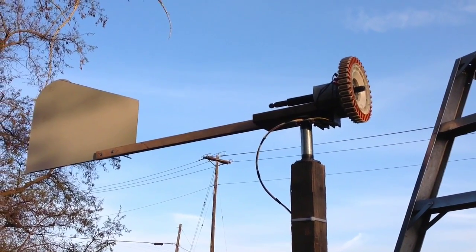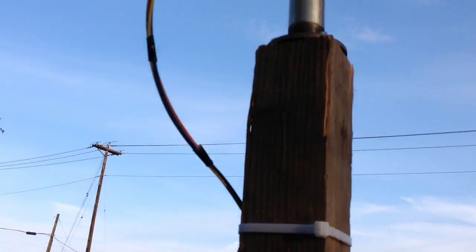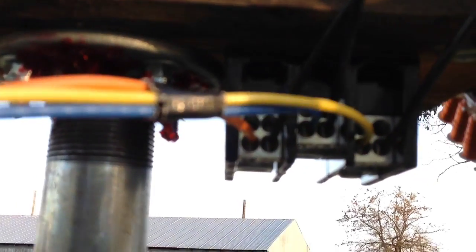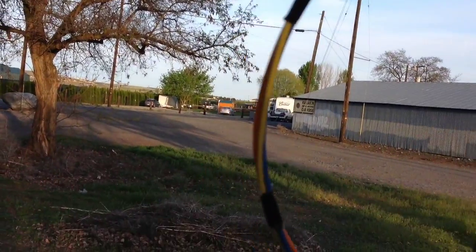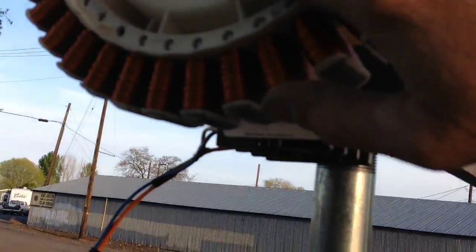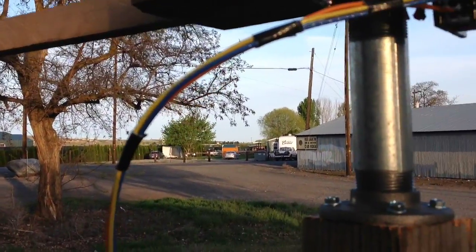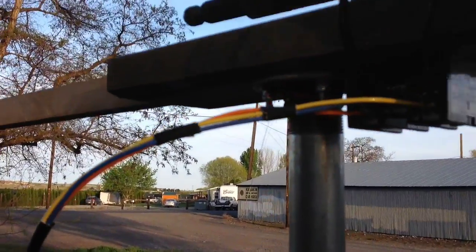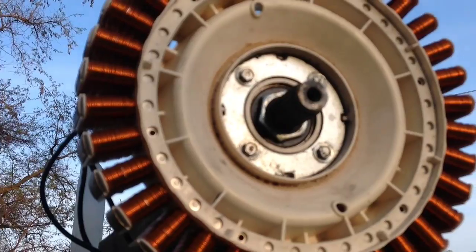Here's how it sits on the pole — of course the blades aren't on it yet. In here I just linked everything together so I can take it apart real nice and easy if I want to. No slip ring on here, none of that. Wind only usually comes from two directions, and I doubt I'll have a problem with these wires twisting up. So let me go ahead and get the blades mounted on here, and then we'll wait for some wind.